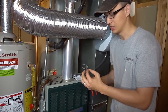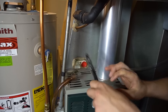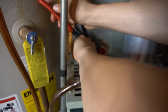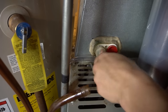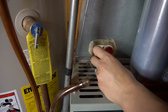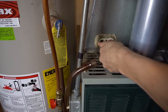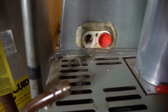So you can just take a piece of wire and try to jam it into the fitting and clean it all out. Or you can just take some pliers or channel locks and take this fitting right off — it'll spin right off like that. Keep in mind that if your drain pan is backed up and there is a plug in here, when you take this out, you're going to have a ton of water come blasting out of there.